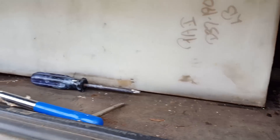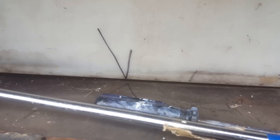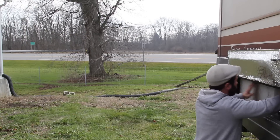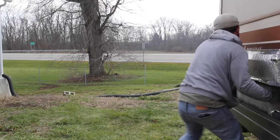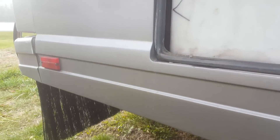Something about plastic that's been stuck together since the 80s. In order to disconnect that I got the old patented Luke hammer and pry bar combination - you put it there and it gives you a little bit of extra pry on there. We're disconnected. Occasionally my brain wakes up and a little alarm goes off saying I'm about to do something stupid. Before I pull this out - you see how small this little fitting is and how important it is that this lines up correctly - I'm going to mark it in several spots so that when I slide this tank back in I know I'm in the correct location. As long as those line back up my fitting should line up. Well this is fun - the tank itself will not fit out of this hole, so I have to take this whole piece off to get it out.